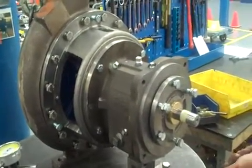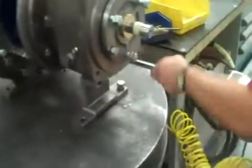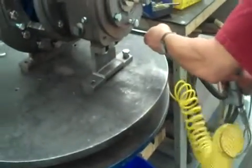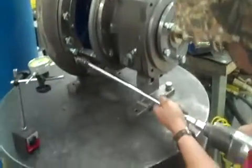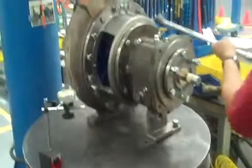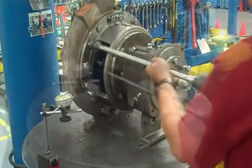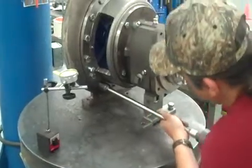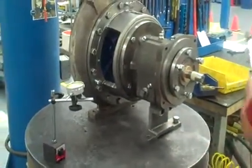So keep these nice and loose before you tighten the case bolts. Using a torque pattern, I like to start off at the bottom a little bit. On this side, over here and this. Just kind of keep doing it. Okay, that'll do it on our case.